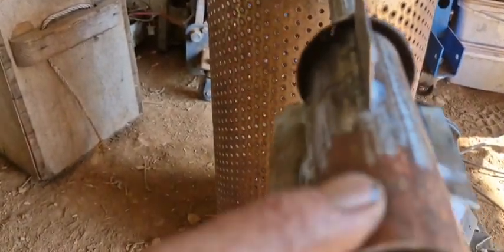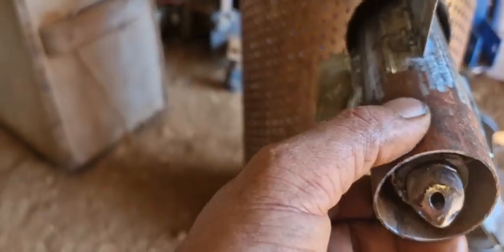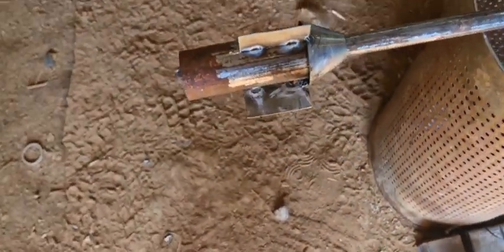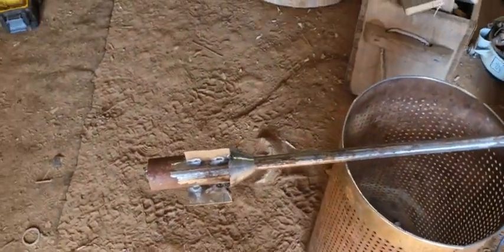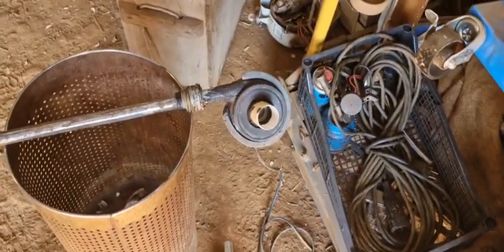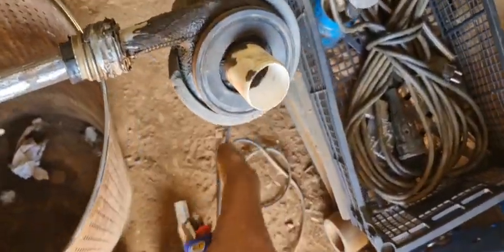It can slide - I can adjust it with washers. You want to see where the venturi begins and ends; you want it at the highest point possible because then the flame can burn all the tar and it radiates more heat out. I'm very excited to check it out inside the gasifier. But first we need to check how it works with the venturi effect. We have a small centrifugal fan from an old broken down vacuum cleaner and I glued this thing onto it - it's a single stage.